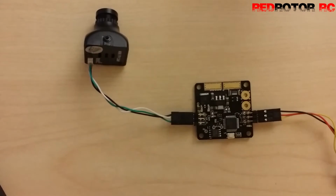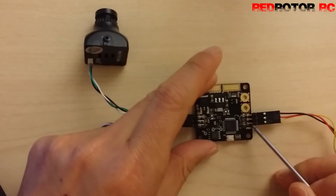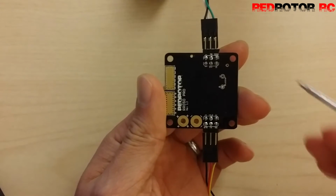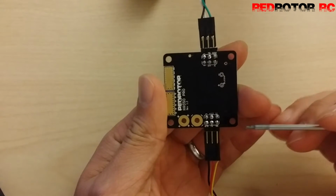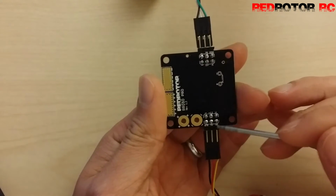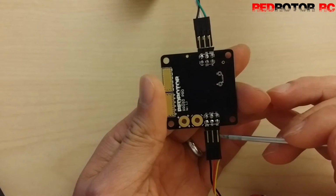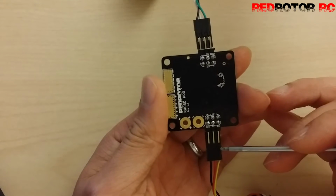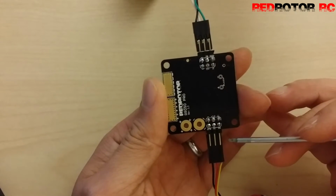The second set of pins on the VTX connector serves two functions. First, it allows you to upgrade the OSD firmware through an external programmer. And second, it can be used to connect to a lap timer transponder. And we'll talk more about the lap timer feature in the next video.